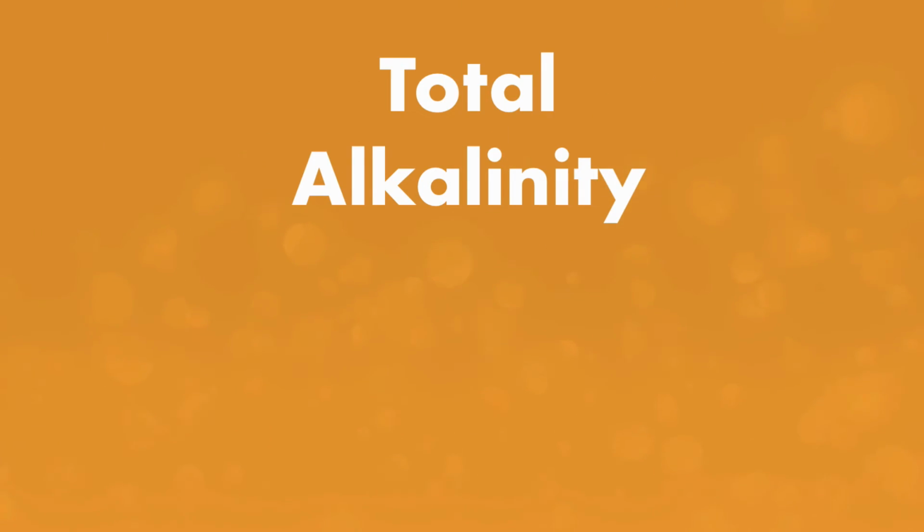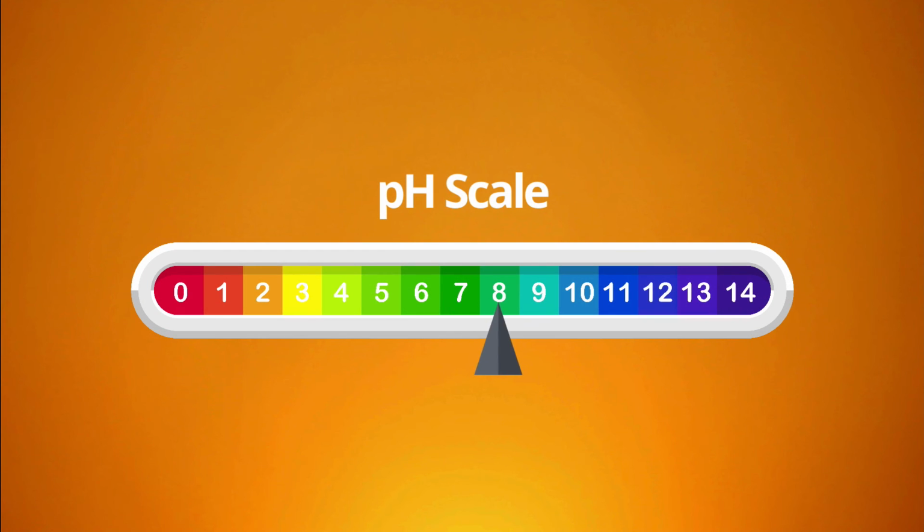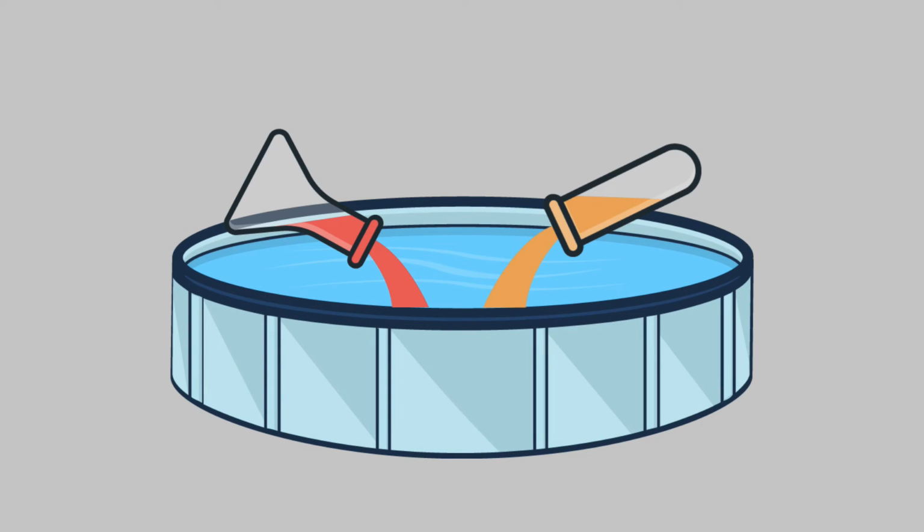The recommended alkalinity range is 100 parts per million to 150 parts per million, with 125 parts per million being ideal. And the ideal pH level is 7.4 to 7.6, with 7.5 being ideal. If you want to learn more about pool chemistry, be sure to check out our other videos.